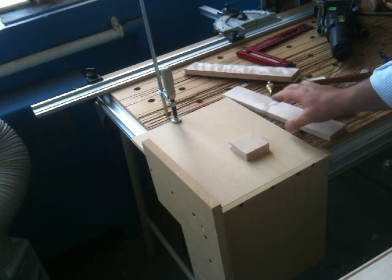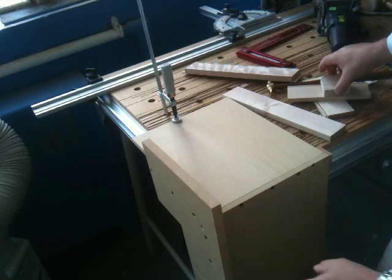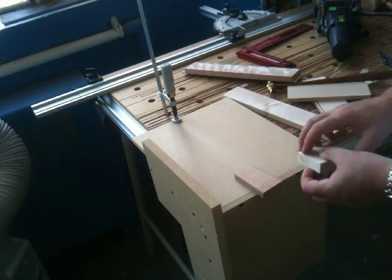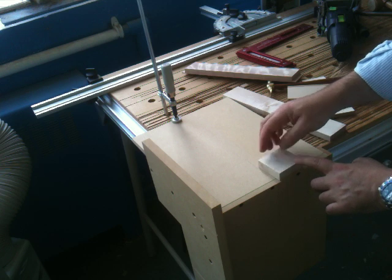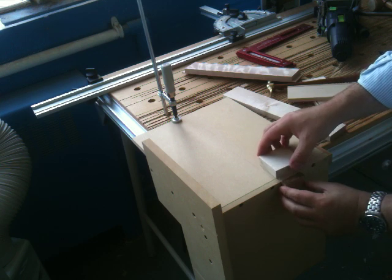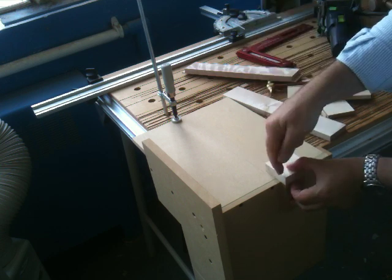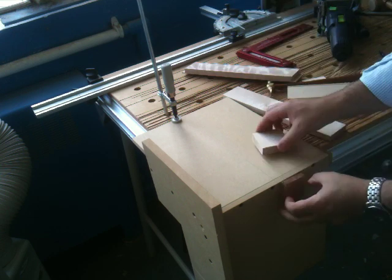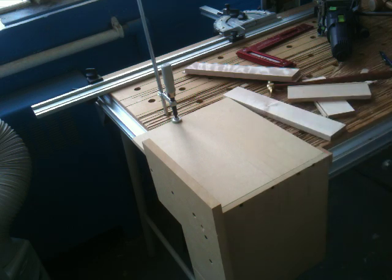So anyway, it's a pretty useful jig that I saw adapted from a dovetail book. As I said, essentially what you would do is the same sort of thing. Let's say you have your tails on this piece, and you want to mark for your pins. You'd move that over there like that, clamp, and you take your marking knife and mark away, and then you go away and cut these. So yeah, that was from Bob Waring's book, Essential Woodworking, I think it's called, which is excellent.